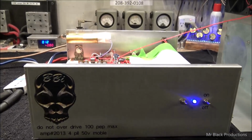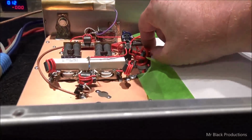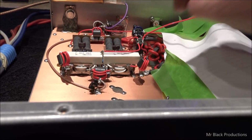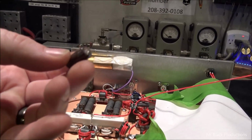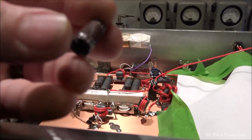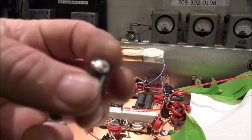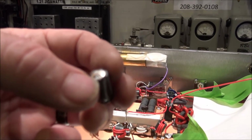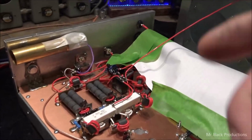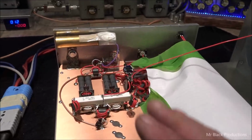So I just want to do a quick look on the inside of this thing here. So Mr. E, you're correct. Your sideband delay capacitor looked like it broke down for some reason. The side of the case is bent, and I'm pretty sure this is where the little bit of smoke you had came from. There was no residue on the inside of it. I went ahead and added a bigger capacitor so we could keep the relays latched up a little bit longer. This is a 50 volt bipolar box, you guys.